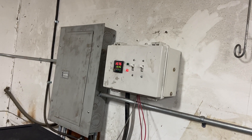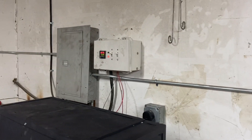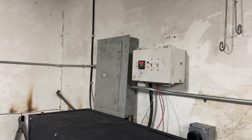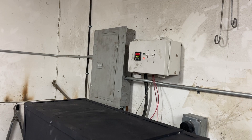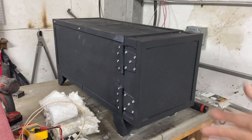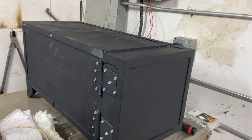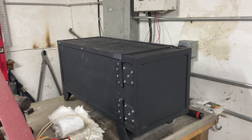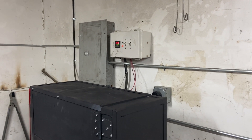I'd say it's definitely made a difference and it's certainly worth the price given these results. I'm much happier with that — not that a 10 or 15 degree fluctuation would have necessarily ruined anything. To be fair, my previous oven had a slightly different fire brick from a different manufacturer, which might have been a little more efficient, and I had a different element and slightly different construction. These bricks aren't mortared together like the other ones were, and it's a slightly different geometry with a larger coil. But I was still expecting better temperature stability from my controller.